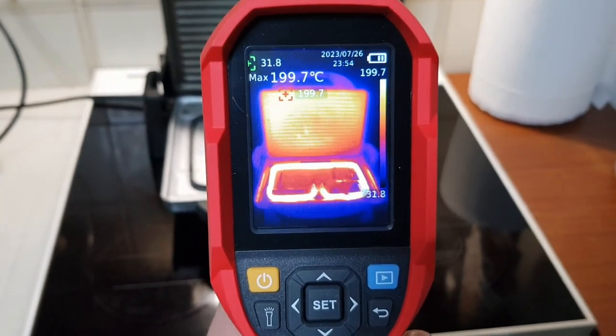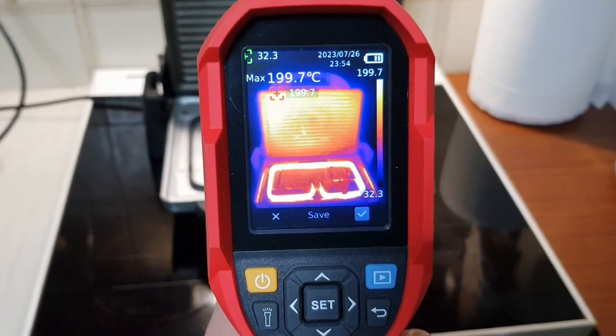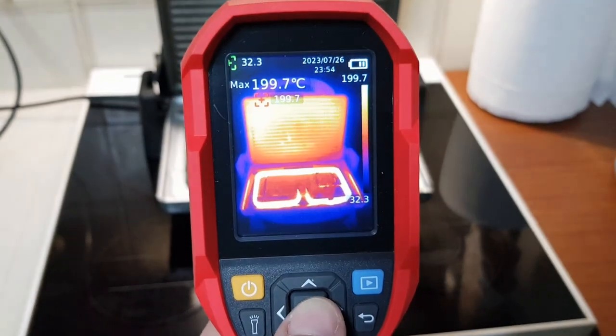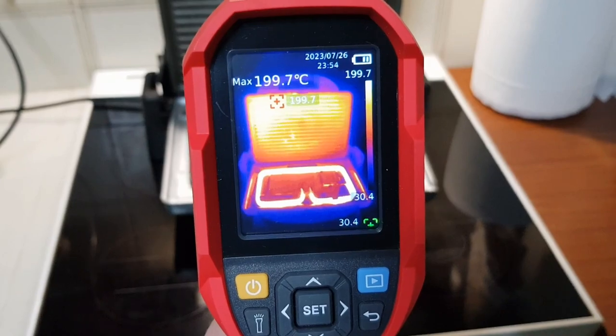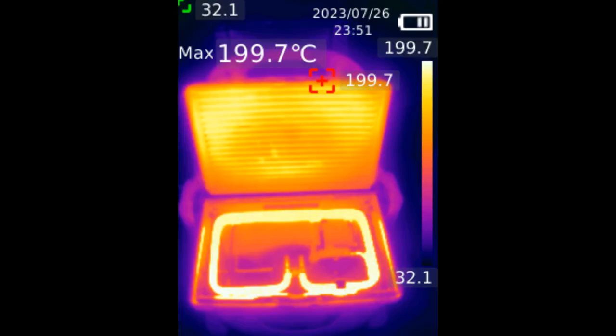As you can observe from the video, the camera displays a color spectrum, ranging from cool blues to warm oranges, yellows, and reds. The hottest areas appear in yellow, while the coldest areas appear in purple. This information proves invaluable for identifying heat leaks, insulation failures, or electrical malfunctions, especially in industrial, construction, and maintenance applications.